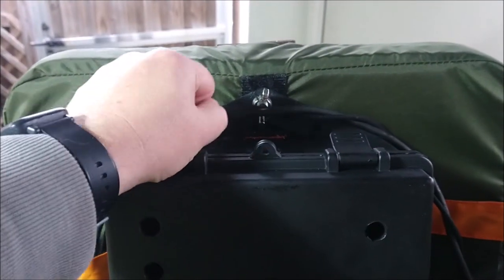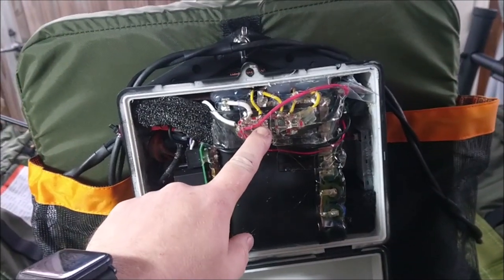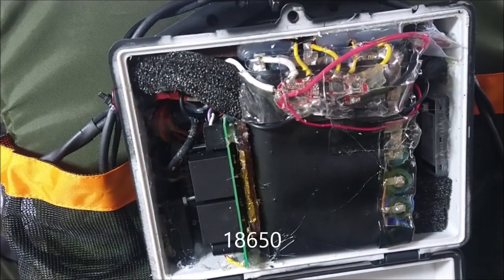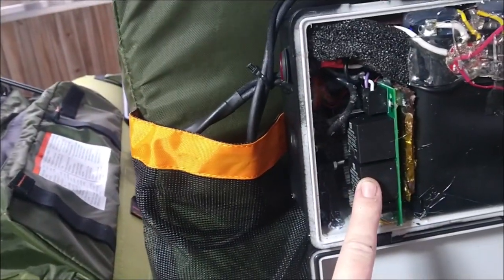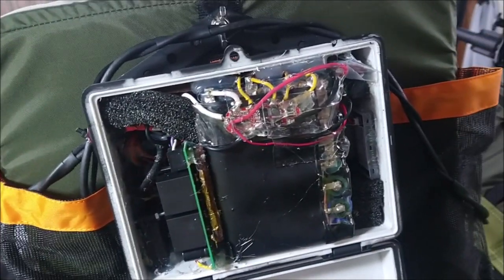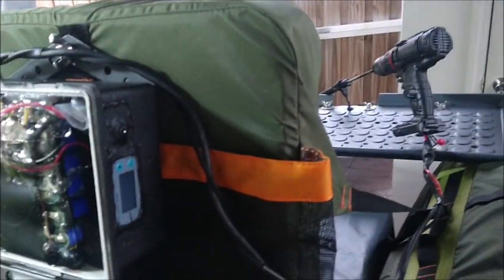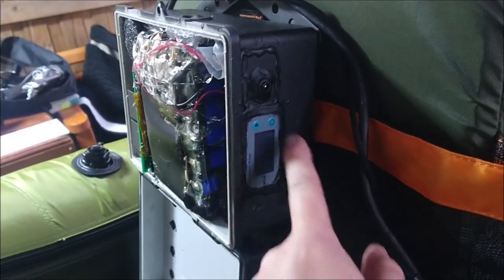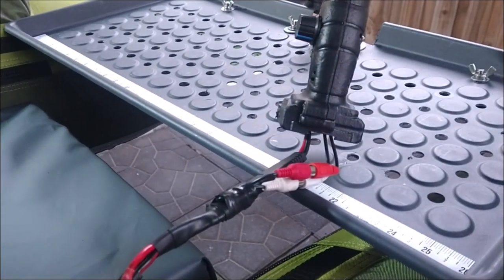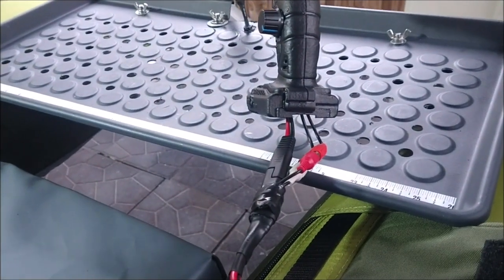The battery is about five pounds. It looks like a bomb but it works — it's a 5s 7p pack. I reused 18650 cells from scooter batteries I found on Craigslist. This is a 50-amp speed regulator, about twenty dollars on Amazon. Instead of using the drill's speed regulator, I removed that one and I'm running the battery through the external speed regulator. I also have a battery meter, with wires coming in — I may swap the connector for a five-pin waterproof plug since it's not waterproof now.